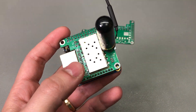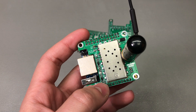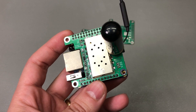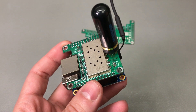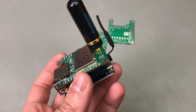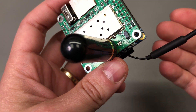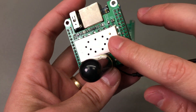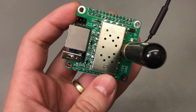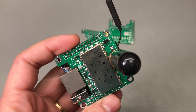In terms of functionality, the schematic can be expanded to add more features — for example, you could have digital control over the output power setting by replacing the manual jumper with a transistor and using a spare GPIO on the Orange Pi, then adding that functionality to the web interface. On the power supply side, the diode voltage dropper used to drop voltage from the Orange Pi Zero to an acceptable level for the radio module could be replaced with an LDO, which would also improve power supply noise rejection — but that's just a nice upgrade for a future revision.